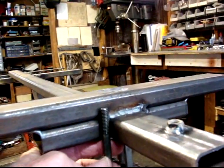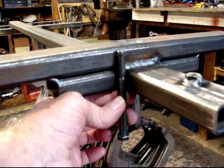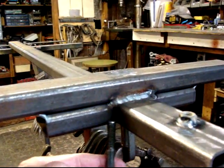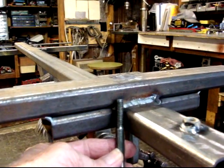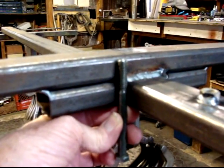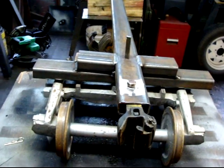From the top, the bolt is screwed in with the head hanging down, comes all the way through the top, threaded through the top with the 3/8 hole at the bottom. You drill the top hole 3/8, drill this one 5/16, and thread this 3/8 — all three are 3/8 — so the bolt will go through the top.